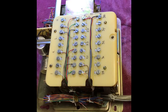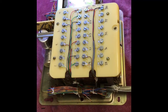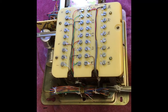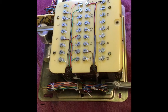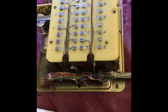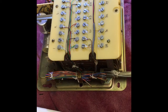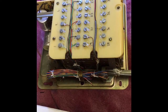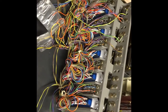I have the 55B control unit now wired up. This unit is plugged directly into the 631 telephone set on the 5th Amphenol. I ran a 25-pair cable and pulled out the 13 leads that were required to connect the 55 control unit to the 667 transmitter controller and the speaker. The inside of the 631 telephone set.